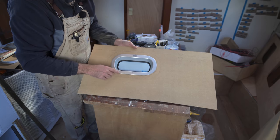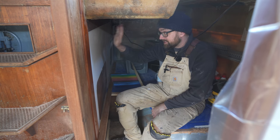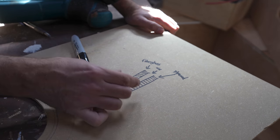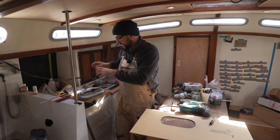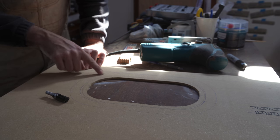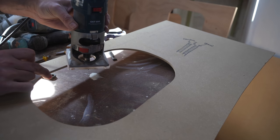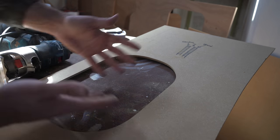I need to make a template for the cutout. If I would have been mounting the port light somewhere with just solid fiberglass, my life would be a lot easier. But here in the darkness there is a layer of plywood, then an air gap, and then solid laminate - fiberglass, air gap, plywood. None of the port lights I could find could handle this width. That makes this process a heck of a lot more fiddly, because I want to have a little reveal around the port light so I can get down to a thickness the port light can actually handle, but I also want that reveal to look nice. That's where this flush trimming bit and the outer ring on this piece of MDF comes into the picture. So this will be the reveal around the port light. I think it'll look good, but there are still many steps ahead of us. I've just double checked to make sure I've got enough room up here for my router, because there is a piece of trim in the aft cabin and I don't want the router to collide with that.